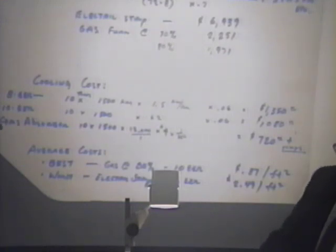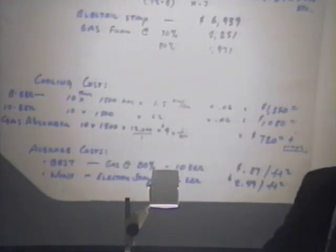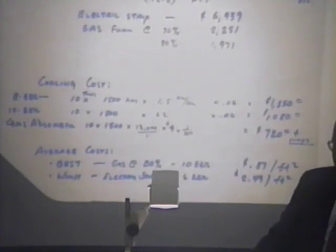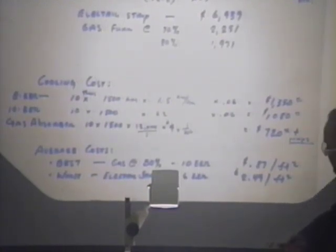To give you another little thought about centrifugal chillers and gas fired absorbers, a good split system is a 10 EER, and it shows 1.2 kW per ton. If you have a big enough building that you can buy a centrifugal chiller, instead of 1.2, it's like 0.7 kW per ton. So take that number and cut it in half if you had a centrifugal chiller.